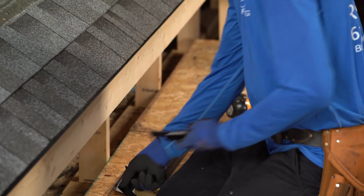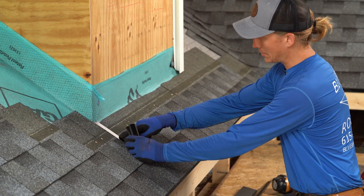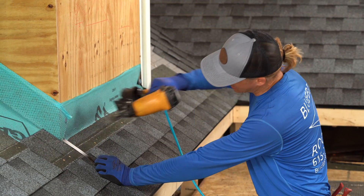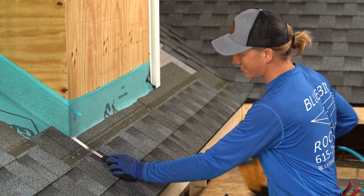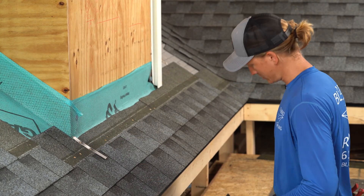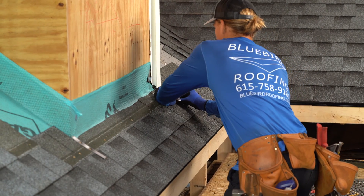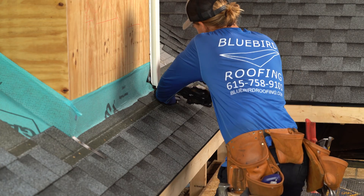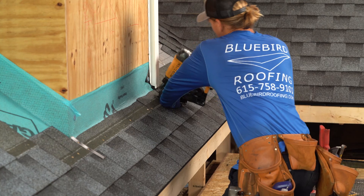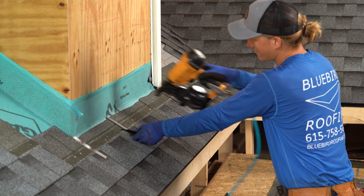Here's my clips. Since they're six inches, if I put it up against the wall, I know the bottom of my apron flashing is going to be an inch and a half away. So if I put my nails at two and a half inches up, I know they're not going to be exposed, but they're going to be low enough to really hold that apron flashing down. Put one at each corner, put two nails in, and then you want to install these every two feet.